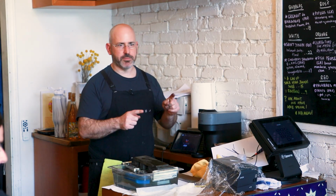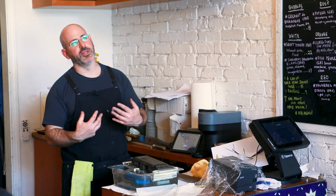If you want it to set in a little bit more deeply, you can warm stuff up. If you put the handle or saya in a really low temp oven, no more than 200 degrees, maybe 180 to 200 degrees, check the temp because ovens are always off. Don't be over 200. You can warm everything up, and then when you apply this stuff, it will soak in a little bit more deeply, so it's a little bit longer in between the times that you have to do that kind of stuff.